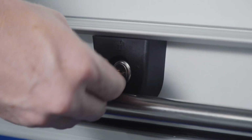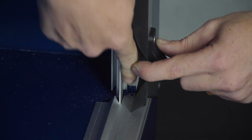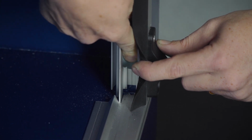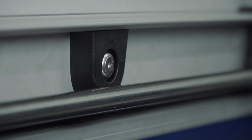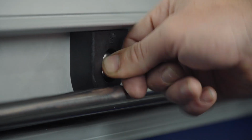If your roll-up door includes the 2-point locking feature, use the provided 1/8 inch diameter pilot holes to place a small amount of modeling clay or plumber's putty. Close and latch the door and attempt to lock it. This will mark the putty precisely. To drill out the locking rod intercept holes, use a 3/8 inch drill bit at this mark.